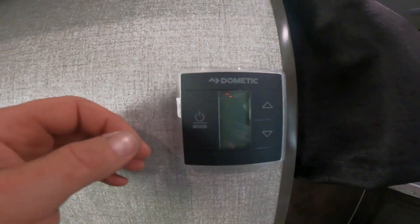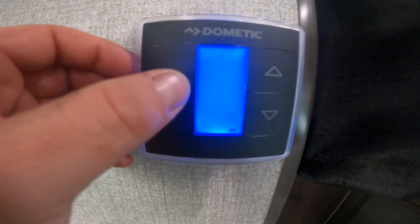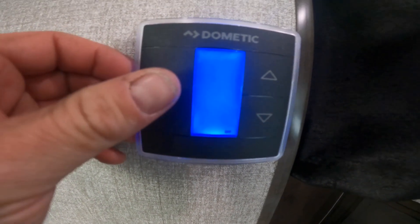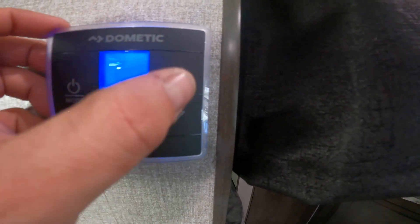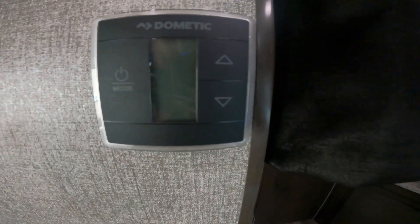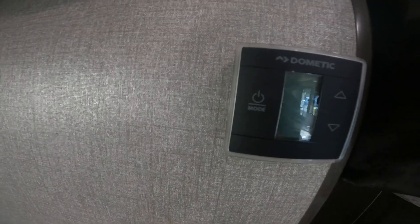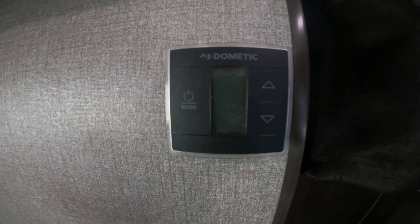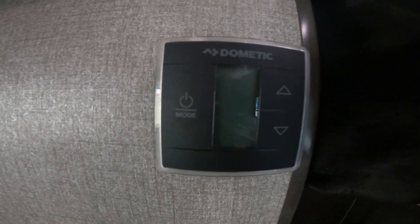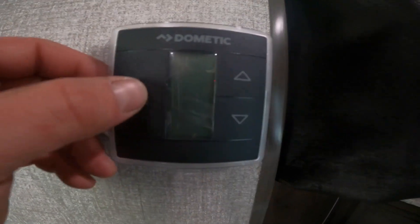The thermostat is a capacitive touch button, meaning it's not mechanical — you don't actually have to press it in. It's just a very light touch to cycle through the options. You have your fan, your AC, and your heat, and then you can cycle through a high, low, or auto option on the fan settings. If you have the furnace set to come on using the high fan setting, it will also use the air conditioning fan to give it extra volume and air. That doesn't mean the AC is actually cooling — it simply uses the fan to achieve a higher volume of air. So if you find the AC fan is blowing loudly and you don't want that, go into the settings, hit mode until you see fan, and make sure it's set to auto.